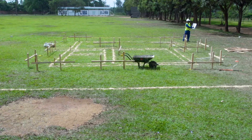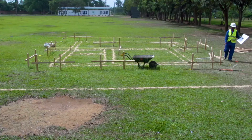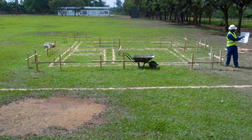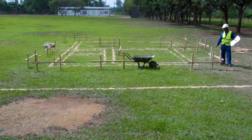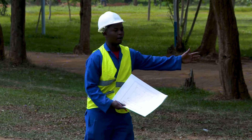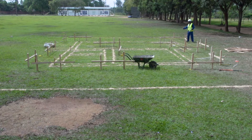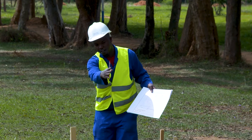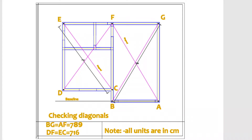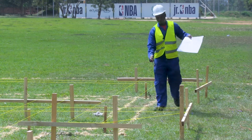It means it is from here up to where we start our building, as indicated on this site plan. Also you have to check on the right side — you have to maintain this 3 meters 30 cm. It means from this plot boundary up to where we start our building is 3 meters 30 cm. From the site plan, this is where we have established our baseline. We set those 70 meters and those 3 meters 30 cm, and located the first corner of our building. We established this baseline AB — this corner is corner A, and we established this first peg and this line to corner B.